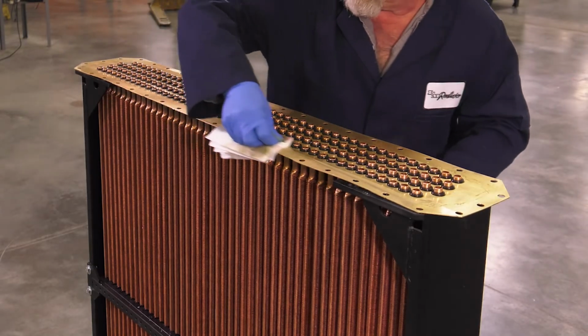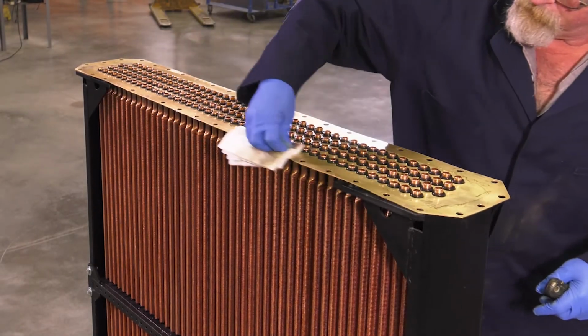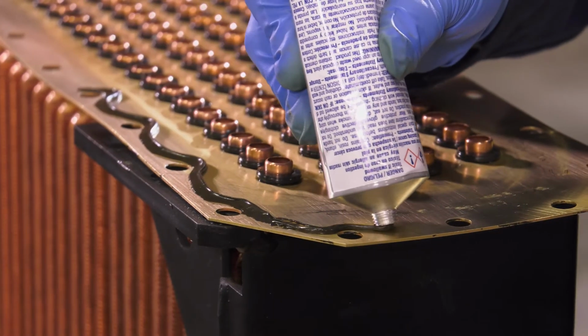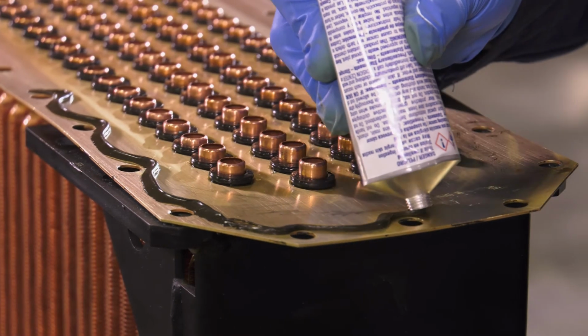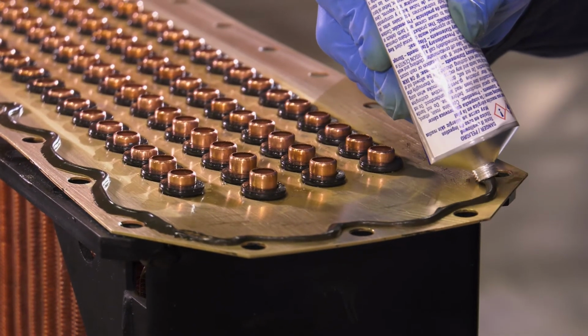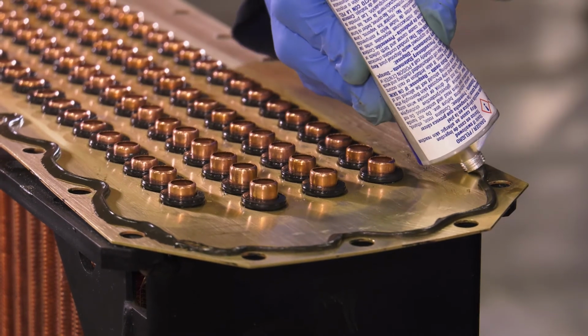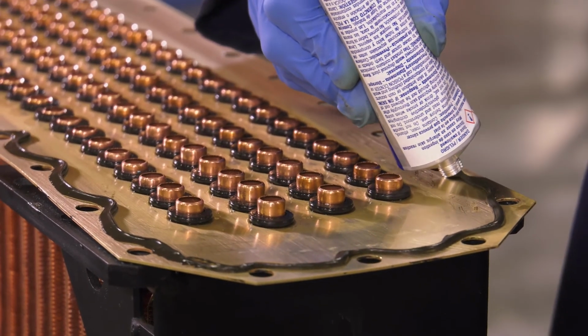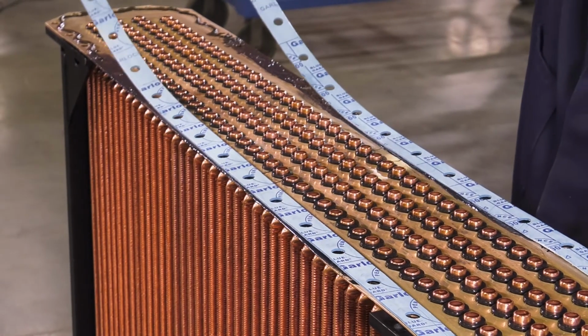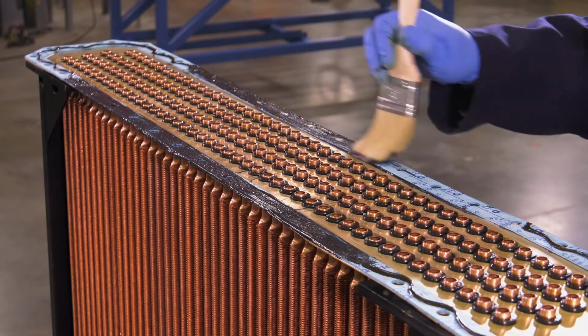When installing the tank gasket, first make sure the tank header is clean and flat. Then coat the header over the side member flanges with a coat of number 2 Permatex or equivalent. Use grease similar to the one called out in the service manual and coat the remaining header surface. Install the gasket and coat the top side in the same manner.